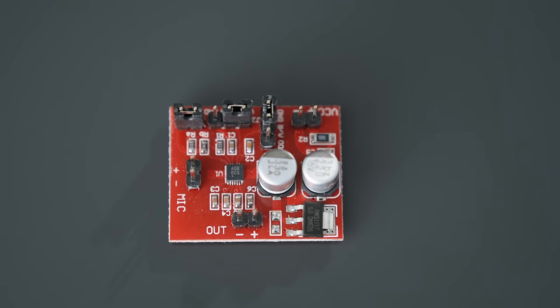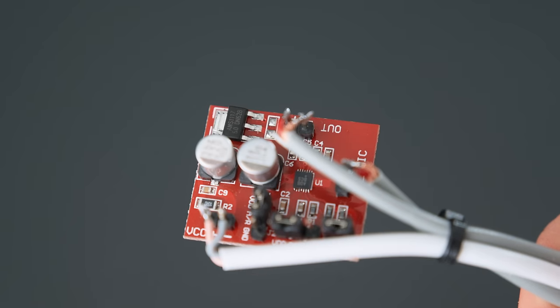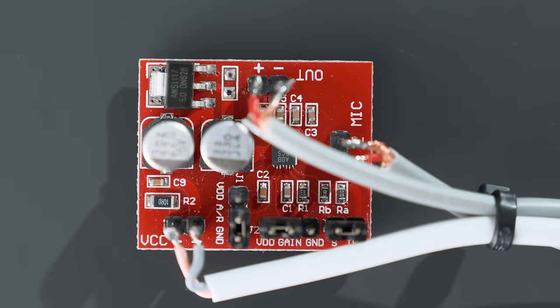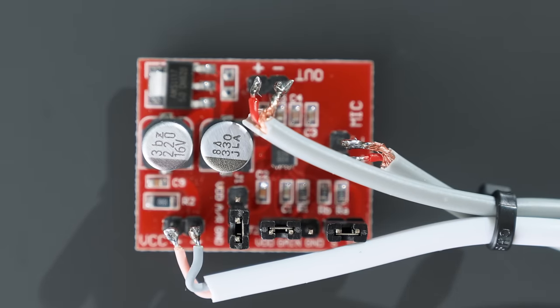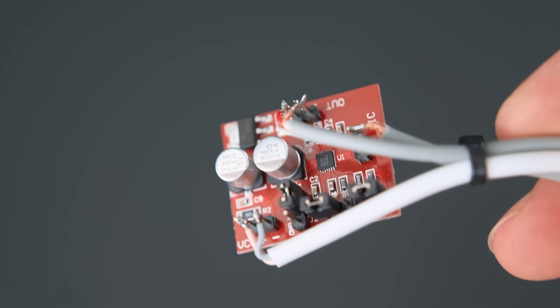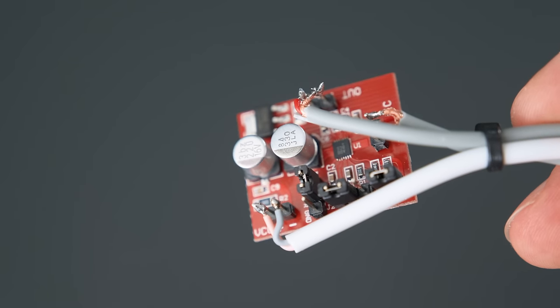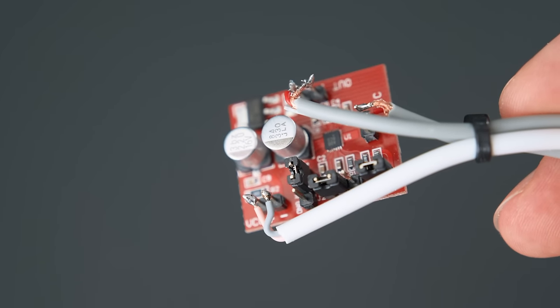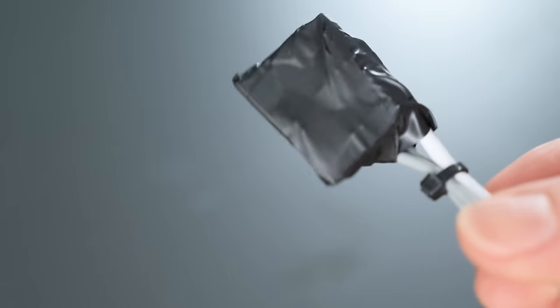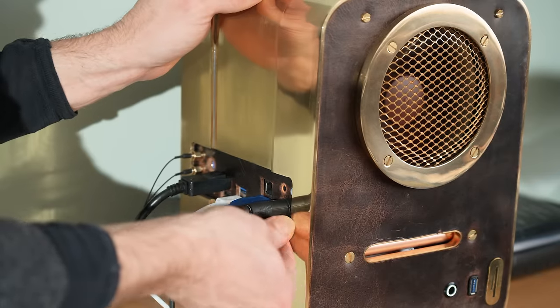The microphone still needs amplifying as computers typically don't have very good microphone preamps, so their microphone inputs usually introduce a lot of hiss into the audio signal. The preamp I recommend can work off the 5V provided from a USB port, and it's easy enough to wire up. Looking closely at it, you should be able to see a few little jumpers. These allow us to adjust the behaviour of the amplification, controlling both the overall volume and also the reaction speed of the board's auto-gain control. This auto-gain control can reduce the volume if the input is too loud, so you'll never get sound clipping if you talk too loudly or shout. Once covered up, this can be plugged into a computer's USB port and microphone input, and then used as a decent sounding budget microphone setup.